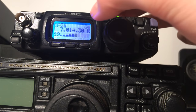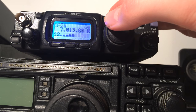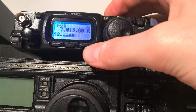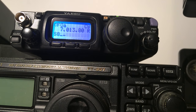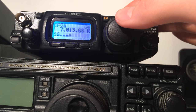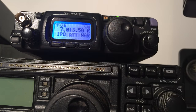Let's leave it off for a minute and go down about 500Hz. You can still hear them quite clearly without the filter in place. If I switch it in, it's still there but very much attenuated. And if I go down another 300Hz, they're essentially gone. And if I take that filter out again, they're very present without the filter installed. So it's doing a lot for me there.